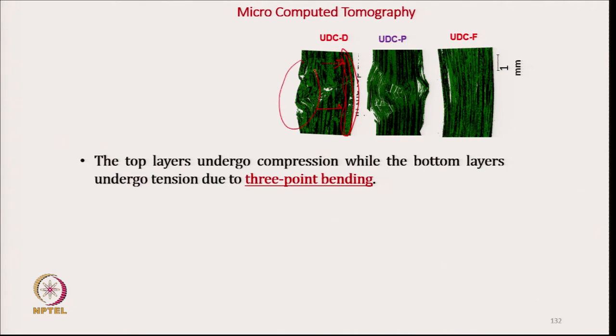At the compression side, the breakage is due to pressure causing damage to the fiber. At the tension side, not much breakage took place, meaning there is no proper bonding due to relatively higher void content. On the other hand, the powder-coated composite shows breakage in both the top and bottom sides, meaning the load is being shared by the reinforcing material on the back side as well, giving it very high flexural rigidity.